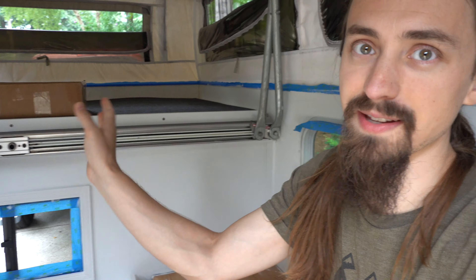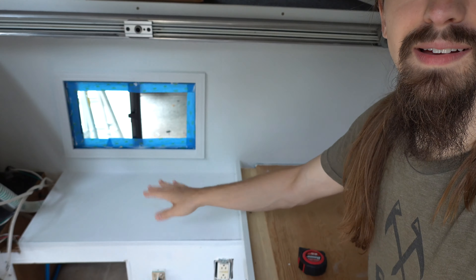It is day three of painting the camper. We are all primed up in here — two coats of primer. Now we're going to focus on doing the gloss paint today, which is another white that will sit on top. We were debating using the Kilz primer as our primary paint but it's pretty flat and tends to hold stains — I had dirty feet and stepped on the bench and it just stayed. A gloss would be a lot easier long-term for fighting off stains and cleaning. We have some leftover white house paint from my parents, so we're just going to do a coat of that and finish this off.